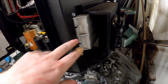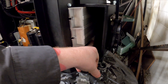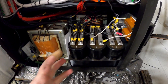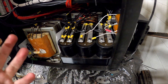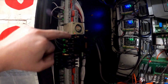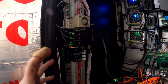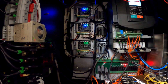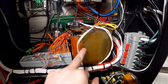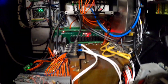A few more resistors on the back — these two are for the dynamic braking on the spindle. And then this resistor is a charging resistor for the capacitors. You don't want to just turn this on because you'll blow a fuse, so this resistor charges for a couple of seconds, and then this timer controls this contactor which then switches the full power on. I reused the control transformer — that's 110 volt for the solenoid valves for the hydraulic system.